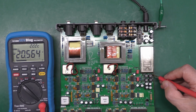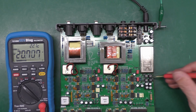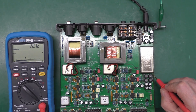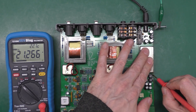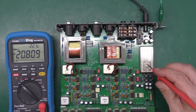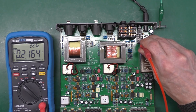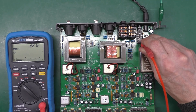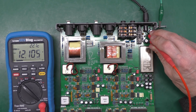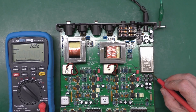I don't think it's the rest of the circuit drawing too much current — those 2.5-ohm resistors would be getting quite warm if that were the case. It looks like it gets worse as the temperature increases. These converters are designed to get warm; the datasheet actually shows an optional heatsink. The incoming 12-volt supply isn't out of spec — pre-diode it's 12 volts on the button — but certainly the DC-to-DC output is all over the place on both rails. I'm tempted to take the DC-to-DC converter out and test it off-circuit.